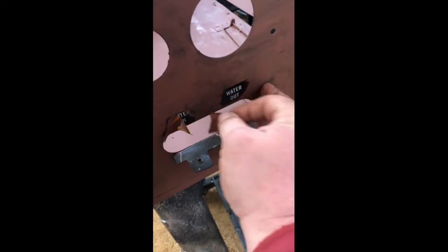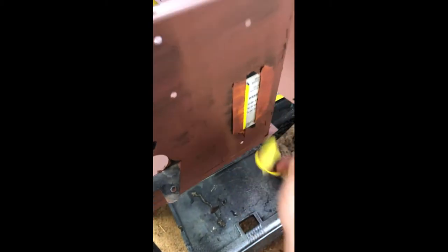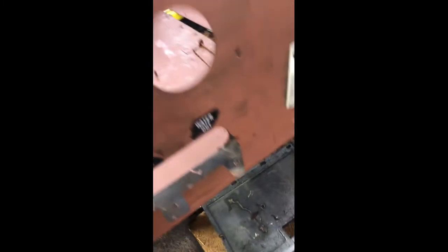These are the blowers. There are two blowers and I haven't cleaned these up quite yet, so I'm going to clean those up — that's what the blowers look like. I'm just going to leave all of that attached; most of them come with just a plug. Take that plug off, clean everything up, and then you can reassemble it. Make sure you take pictures along the way so you know how stuff's going to go back in. If you do any painting, make sure you save any of the labels so you can go back and find model numbers.